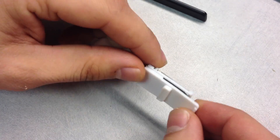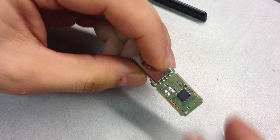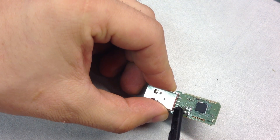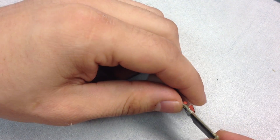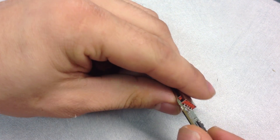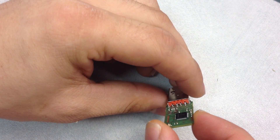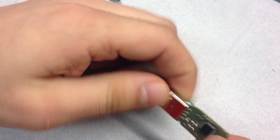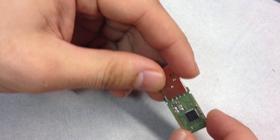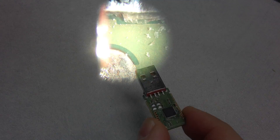So we'll try everything else first before we get into that. In here what we see is our little printed circuit board. The first thing I want you to check out would be these pins here. I have a microscope for that — you can use a magnifying glass or something similar. Get in there close and see if all of the tracks are in place, if the soldering points are okay, not broken, and generally check if there's anything wrong with the input.